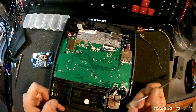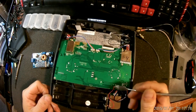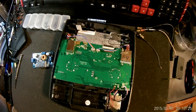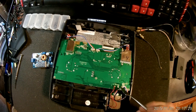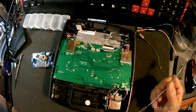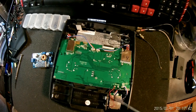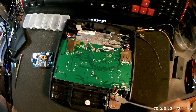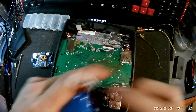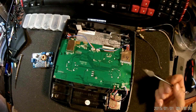So let's try to pop this one out. We're going to make our connection here. Now for people that can't do any soldering, why not look to do a quick splice — do away with the box, cut your wire, leave some of it onto the board, and then use a low voltage quick splice that you might get from a hardware store or automotive store. That way you can do a crimp type butt splice and you don't have to do any soldering when you want to add a connector for your batteries — you'd be able to plug it in just by using these old wires. Anybody can do this if you just use your imagination.